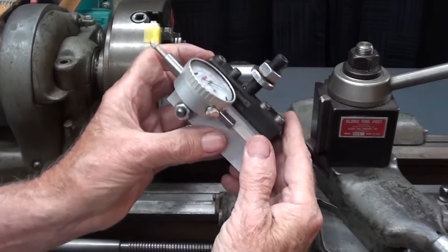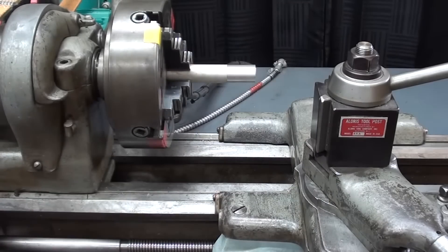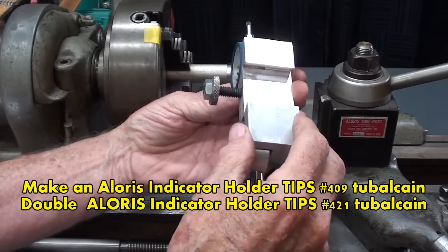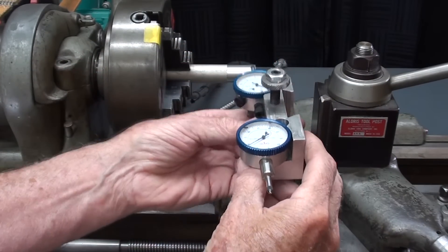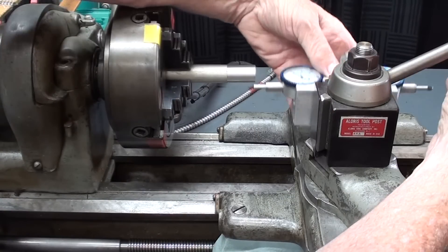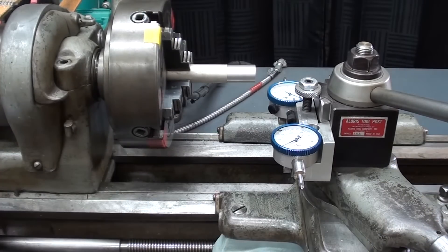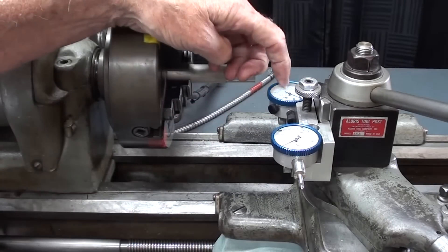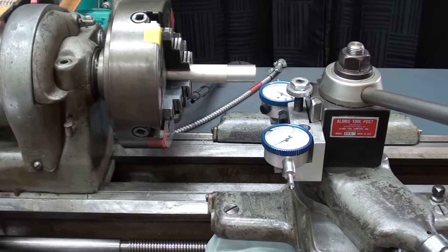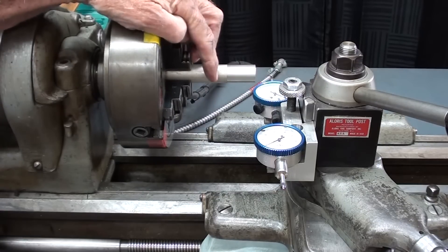These are dedicated indicators — I do not take them out of the holders. I have a video on making this one; maybe I'll put a link down in the description if you haven't seen it. I'm going to use this one, also made out of aluminum. This is a double-acting indicator — it can be used in two different directions, and this is the way I'm going to use it today. I think these came from Shars. Don't break the stem off when you move this, and make sure that the tip of your indicator is on center.